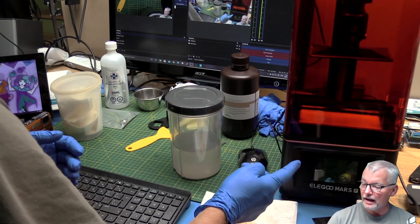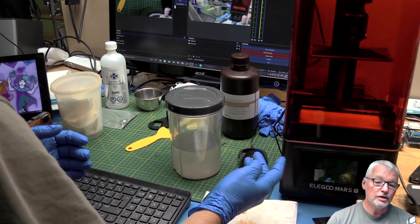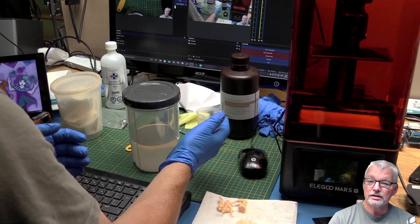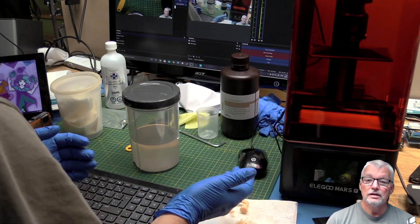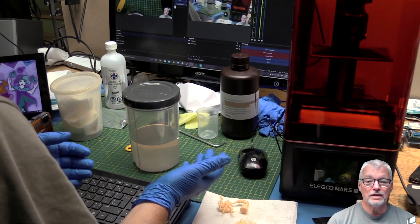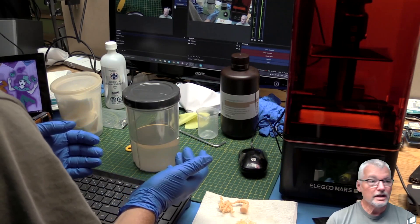The Mars Pro I think is a very good buy right now — it seems very easy to get going with, simple to set up and use. But if you've got younger people using it, definitely with adult supervision. There's nothing hot that's going to burn yourself, but the chemicals — the resin and isopropyl alcohol — are flammable, and the resin is mildly toxic, so you need to wear gloves when handling it. Have proper precautions when using it. Anyway, that's it for now, see you in the next video, bye.